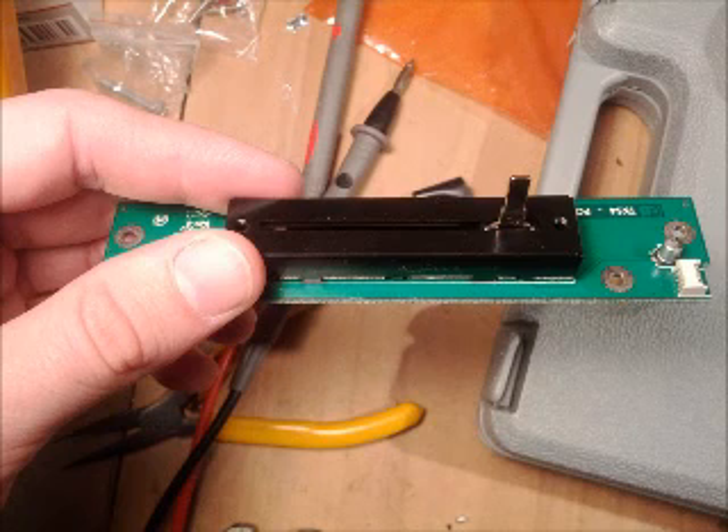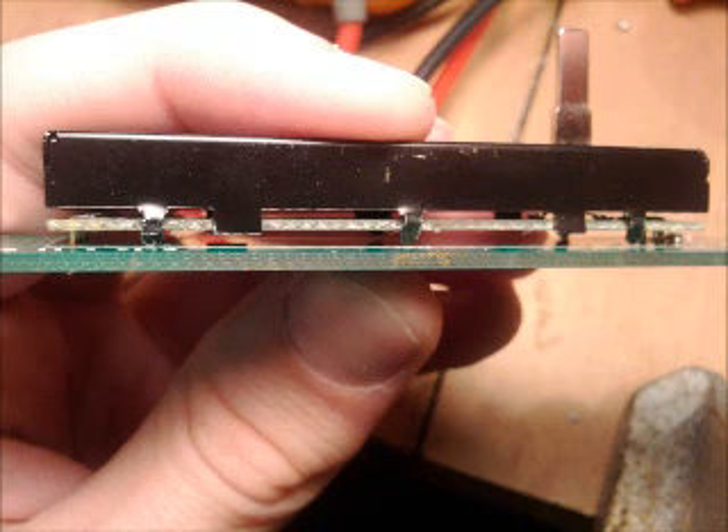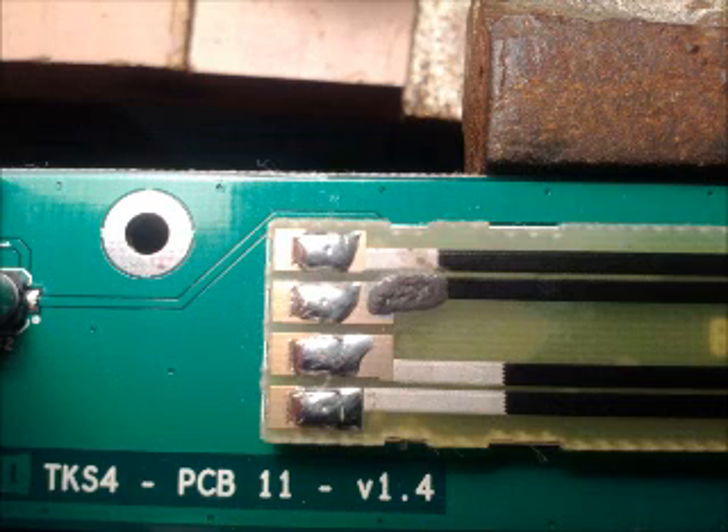Now this is the cross fader circuit board. There are a couple of components on it: just a variable resistor, a capacitor, one resistor, and a smaller capacitor. The job is to remove these six small stirrups that hold the black metal case on the variable resistor. They're just those little bits underneath, so if you bend them down it should come up and you'll get a circuit board looking like this.